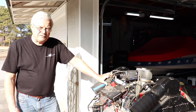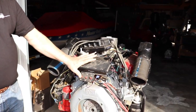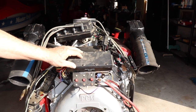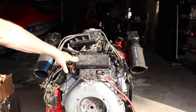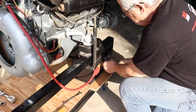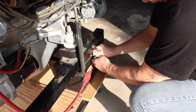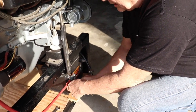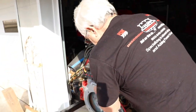So we're going to go ahead and pull the damper plate. The first thing you want to do — on a PCM engine, this is the electrical bracket and your positive battery cable comes in. Because we're dealing with electricity and removing the brackets, we want to disconnect the battery first. It takes a half-inch wrench. You always start with the negative cable and pull that off. I like to pull the positive cable also, because we're going to pull it off of the battery and also pull it off of the starter relay, which is on the electrical panel.